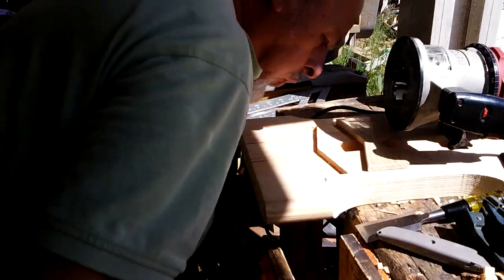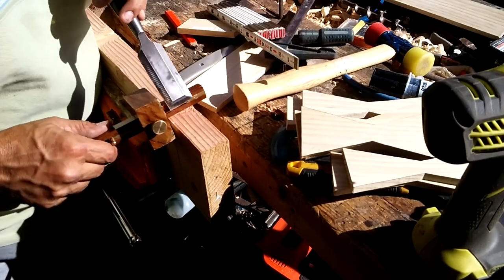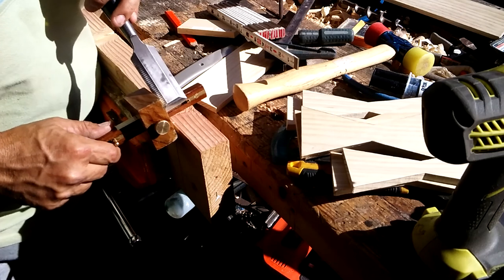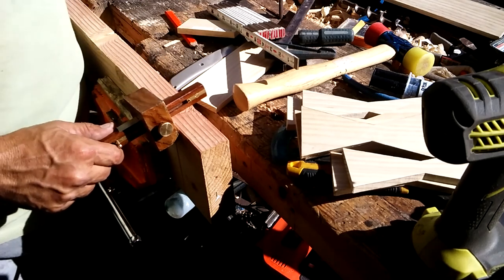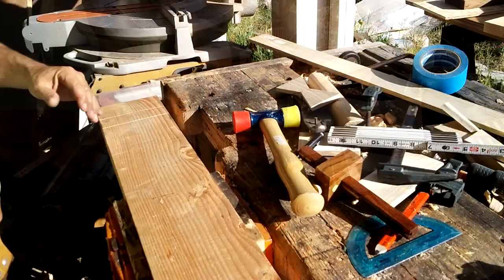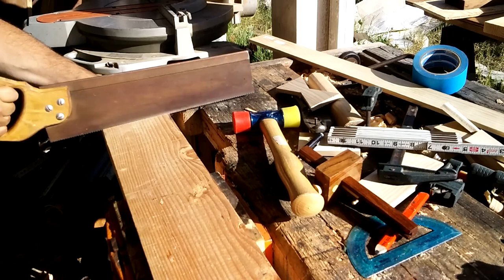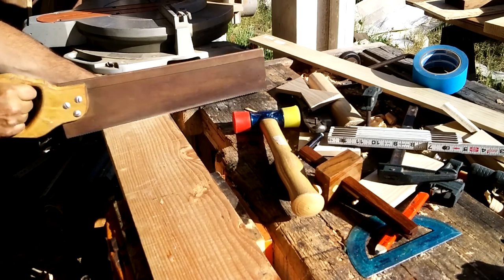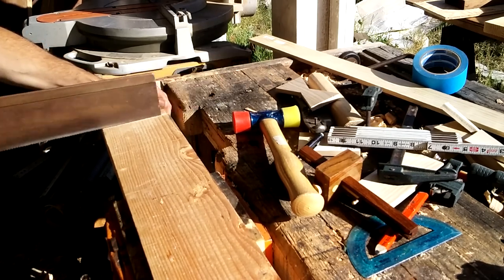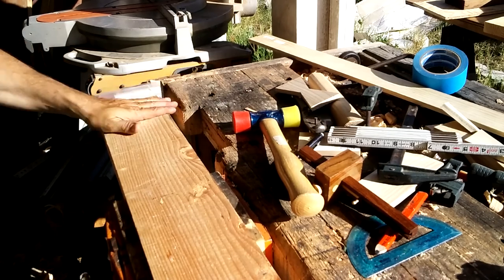So for the glue up. I also used my marking gauge set to the width of my one and a quarter inch chisel, at a depth of one-eighth of an inch from the edge to mark the tenons. Then I made sure that I cut them down to the lines, as you will hear in just a second.